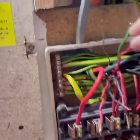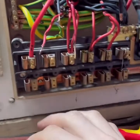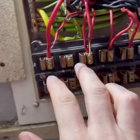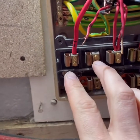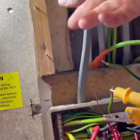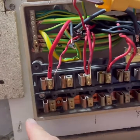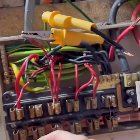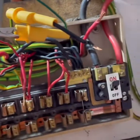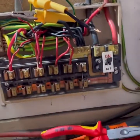Now I'm left with the lights and then mystery circuit number one. The next circuit is the lights. Both of them were in the same fuse - I bet they were - which is why we had two five-amp fuse carriers. I reckon they were downstairs and upstairs lights. Maybe someone installed a shower - that's probably what it is, it looks newer - and they put it in the top rather than down the back, so they put both the lights on one circuit. I'll check both of them, make sure there's no shared neutral, and when the upgrade goes in we can split them upstairs and downstairs.